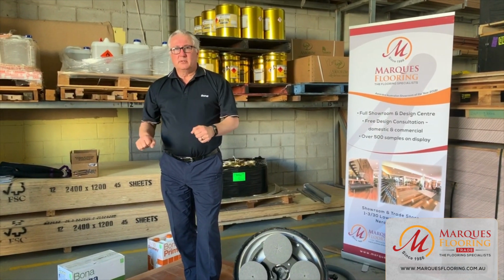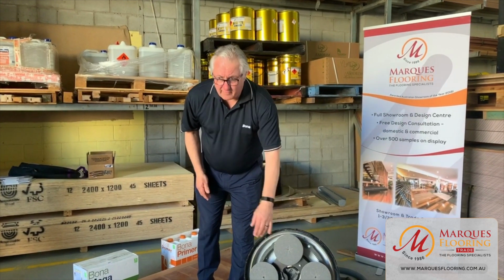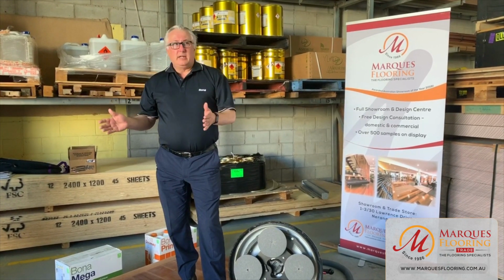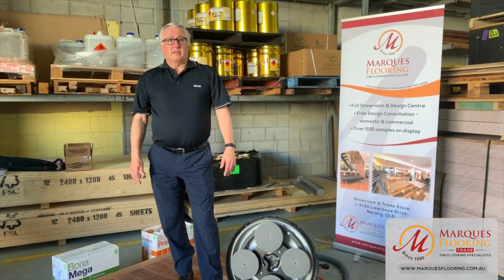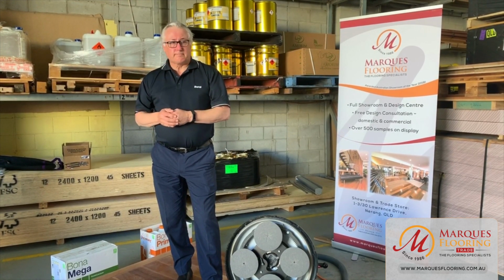The other benefit here too is in situations where you can't get the belt sander in the area comfortably, where you're going to put a lot of sanding marks by cross sanding the floor. This is a situation, for instance, within hallways, bathrooms, galley kitchens, where you can just operate with either 36 or 50 grit ceramic discs to prepare the floor for the next lot of sanding.